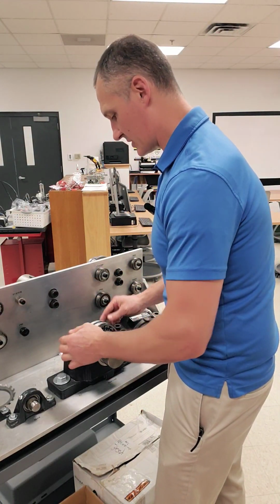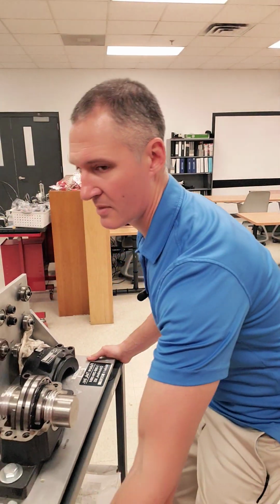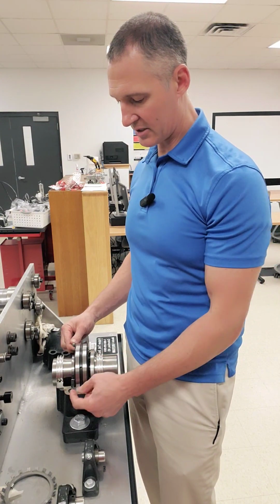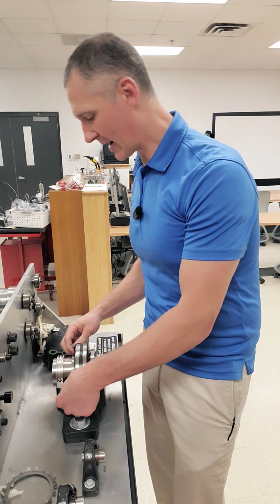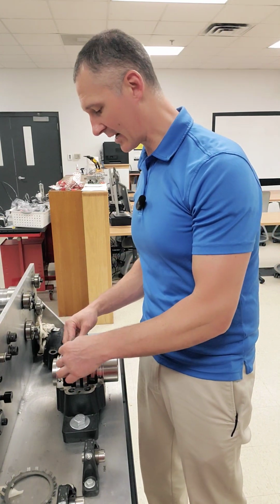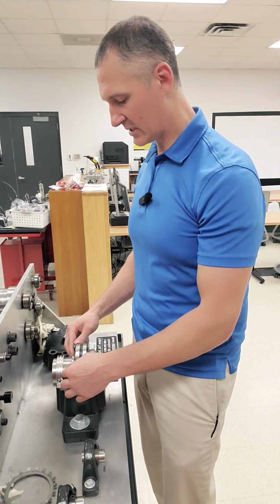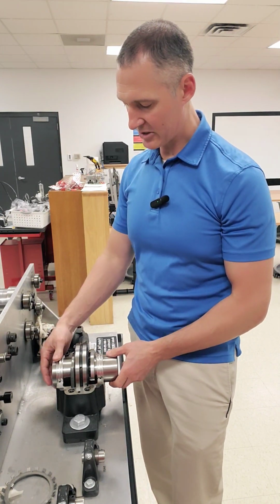So a few things that you're going to notice is, it may be kind of difficult to see. I'm going to move this around just a little bit for you, so you can see this in line. What you're going to notice is that this bearing here, the outer race, fits down in this groove, and it's nice. It's a couple different sizes you could actually put in here as far as widths. And so, you have this spacer here that you can put in. Also, the spacer is really cool because it's set up to where you can actually install it after you're done. So I fiddled around with it actually being in there, which was a more difficult way of doing it. But generally what you could do is set everything up and then force that bearing to one side or the other. The other thing you're looking at here is, again, these little rings.